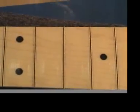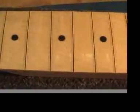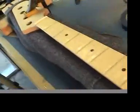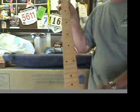Okay, you can see here that I really haven't got any chipping. It's got the serrations from the tangs on the frets, but we'll clean that up with a fret saw. I did have one little chip right there, and what you do is just take a dab of super glue, put it in place, and dab it down. And once you sand the neck down, that'll never be seen. And there you go. There's the whole neck. It's done. So this is it. It's ready to go.